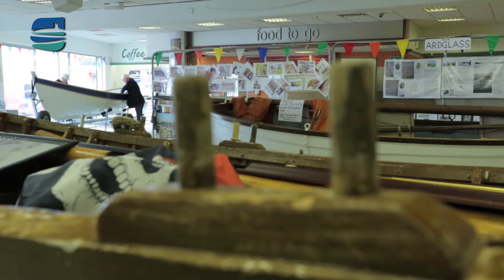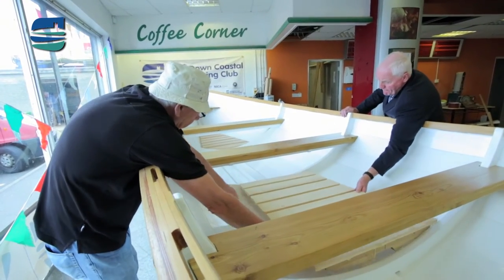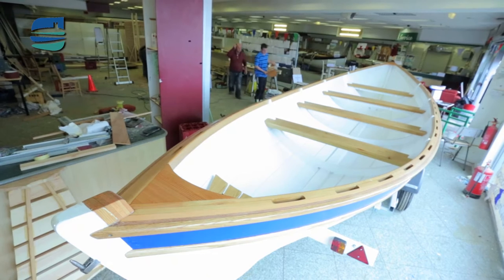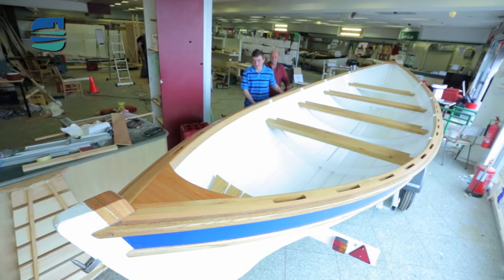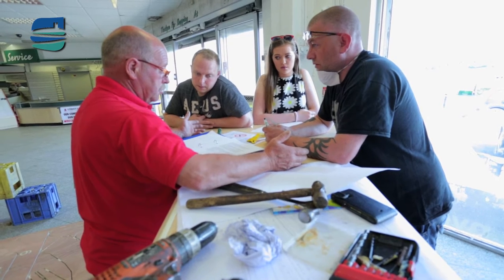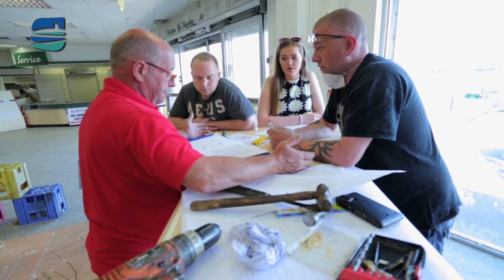The finished length is 22 feet, and it has to be in excess of 150 kilograms — the closer you can get to that, the better your chances in racing these vessels. The biggest obstacle we came across in the build was on the very early planks — the garboard strake, which is the first board that goes on. Between the first frame and the stem it was difficult to get it pulled into shape on the frame, so we set in further mouldings to give us something to clamp to, but other than that everything went fairly well.